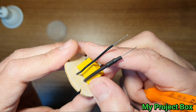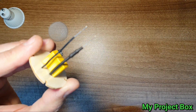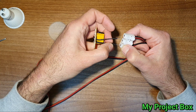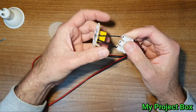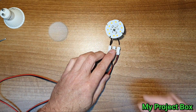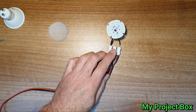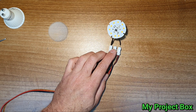Now that arcing could have damaged something else on the lamp, but what we could try and do is put some power directly onto there and see if the LEDs work. Let's apply some mains voltage there and see if they light up. Nothing. So that means something else has failed. So let's dive a bit deeper.